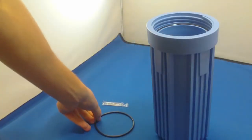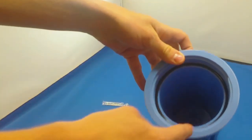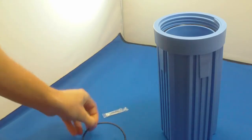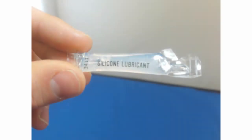The rubber O-ring provides the water-tight seal between the cap and the bottom of the housing. It is important that the O-ring be lubricated with clean silicone grease and properly seated in the groove below the threads of the housing, or a water leak could occur. O-rings usually last about two to three years. We generally recommend they be changed when they become deformed or flattened.